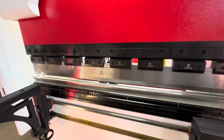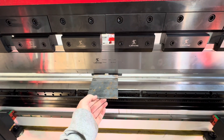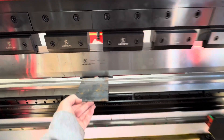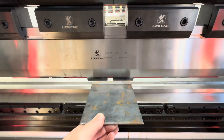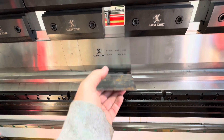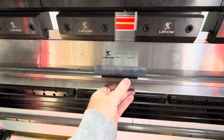If you have a small part like this — this is 11 gauge, small part — we want to go fast. We've got 700 of them to make today and we can't be lollygagging around. The first thing is you can control the ram opening height, so we have a really low opening height and this thing is going to go about as fast as I can go with it.